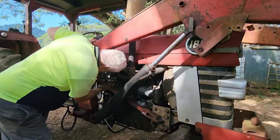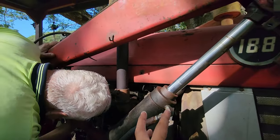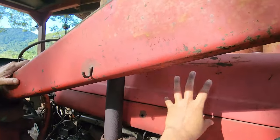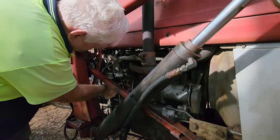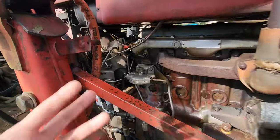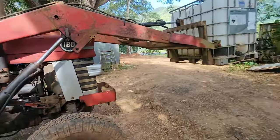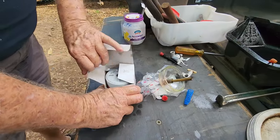Any bad luck, because usually when you have a diesel that is dirty because it's sitting for a long time, you can't really tell which fault it is, because even if you drain the fuel here and have good fuel here, all the system is full of gunk, so it will still cause you trouble. So you need to change the whole filter and you will find it runs smoothly next time. Less stress. I hope so. Okay, that's the second one. Same filter, same brand. Yep.